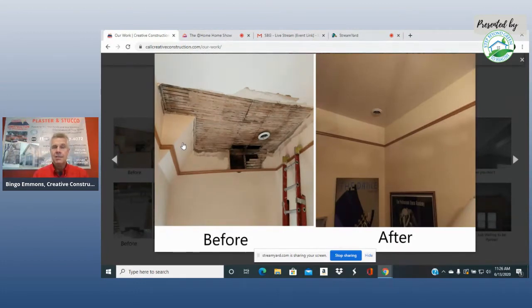They want to plaster over this stuff, and you'll see that you can go to the box stores, you can buy the base coats, you can buy the finish coats. One of the biggest mistakes, and we will never do this in our own company, is where you see the wood lath that's on there, do not reuse wood lath. It's the biggest mistake that I see people do when they try to do it themselves.